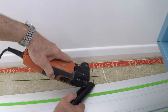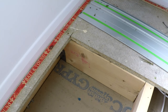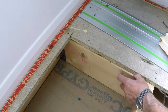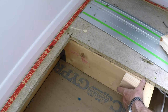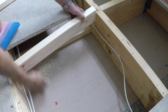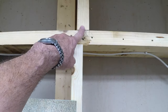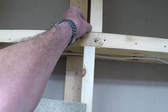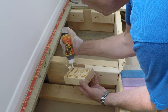The multi-tool did come in handy here, just for squaring off a cut I'd made with the circular saw. Now that I've lifted this piece of floorboard out, you can see there's nothing here really for it to rest on — there's about five millimeters — so I've got a couple of scrap pieces which I'll screw to the sides, one at this end and one at that end, to give it a bit more support. Looking at what I've put in, it doesn't line up with the builder's original — the blade has just nicked the very edge — so again I'm going to have to cut a couple of supports to put on the side.